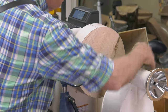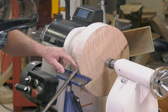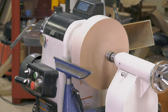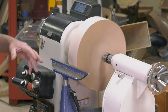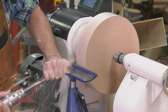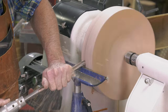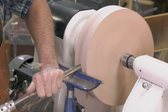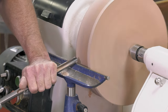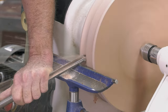That's locked in place, RAM's locked, let's turn it on. The cutting edge is about an eighth of an inch above center line. Face shield down — you can see there's a little bit of wobble, but that's going to happen when you center it up. I'm using the bull nose grind to first establish a shoulder, then truing up the outside to get it perfectly balanced. You don't want any chatter. When you turn, you listen — you can hear that little knocking noise right now because I'm turning into an area where there's a shadow or void where it's not completely round.